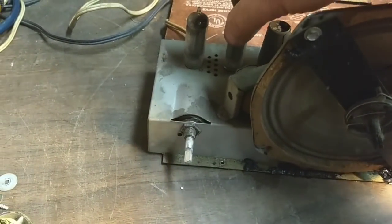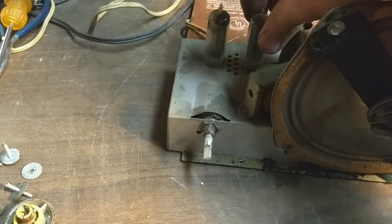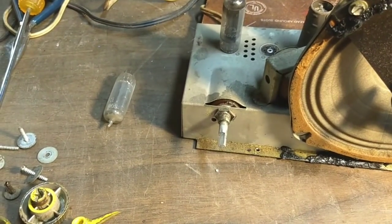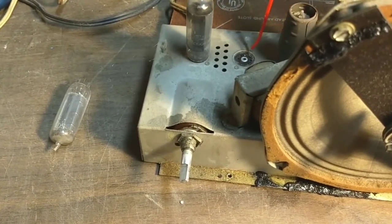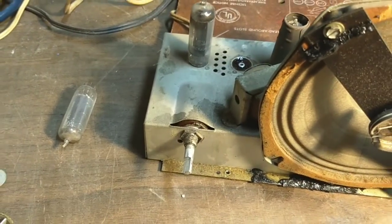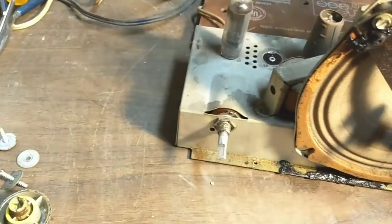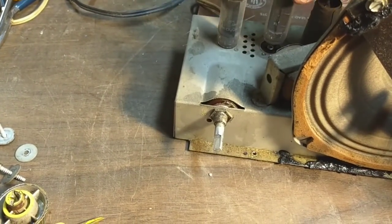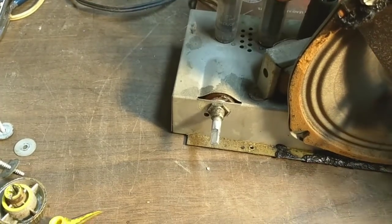Output tube's hot, but not blazingly hot — that's good. I'll trickle a little bit of contact cleaner down in here, just a little bit, and then work the tube in its socket a little, just to kind of clean up the noise. The other one seemed fine.